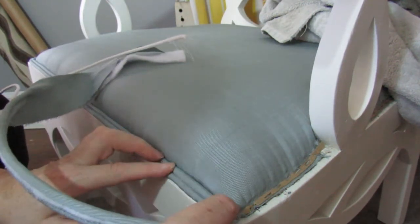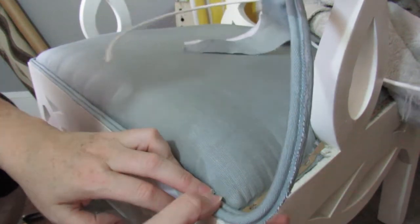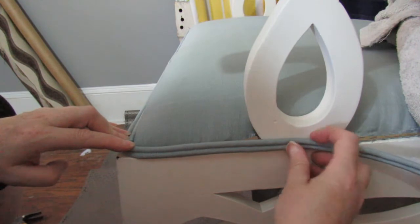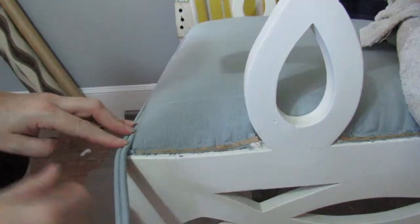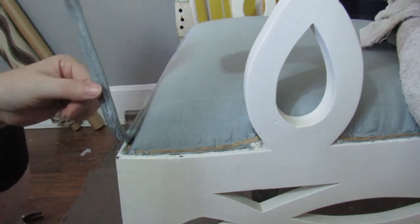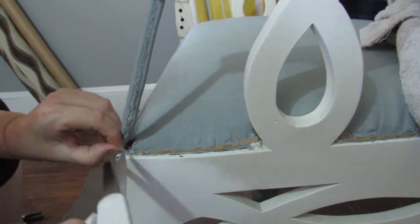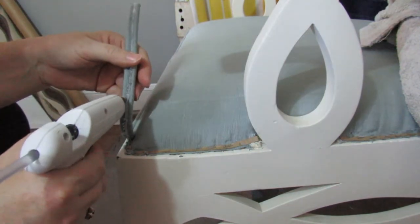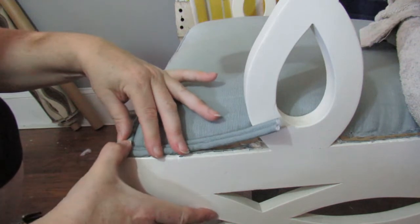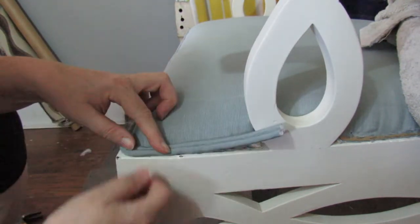I've just got to come around this corner here with my inch allowance. Before I get too far I'm going to bring this around and into here, so I'm going to cut about there so I've got enough to hide under the arm. That's actually pretty good. I'm going to glue it to about here - it comes in and there's nothing really stopping it. I will take that piece of card out because it's a bit rucked up - that just means everything will go in a bit smoother, and some fluffy stuff needs to come out. I'll just put my two or three inches of glue, one around kind of cross and in. Double piping really doesn't go around corners very well - it does if it's more on a bias, but I didn't have enough fabric to put a bias on here. I've got a little bit of glue so I'm going to smooth that out.